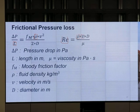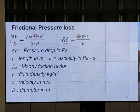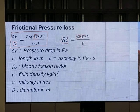When pressure drops, density becomes lower, it expands. So velocity goes up by itself without anyone doing anything, right? And when it expands, there's a little change in the temperature. So this equation does work, but if you use it for gas, it's not quite easy because we have to discretize it. So for gas, we use what?